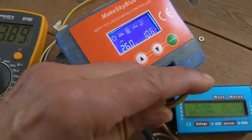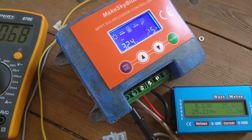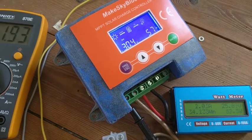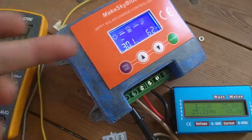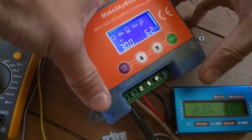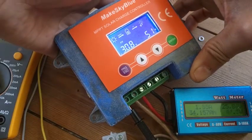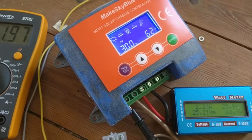Again we're going to 60 watts going into the battery, but if I shortcut it I get 105 watts. I'll use my old one to monitor battery voltage. If you have a 28 volt solar panel and you charge a 12 volt battery it will work, but it's always better to match them. Right now it's 30 volts going to 4 volts making 2 amps — that's 8 watts going somewhere. It's not getting hot, just a bit warm, so maybe those 8 watts are just burned on the backside.